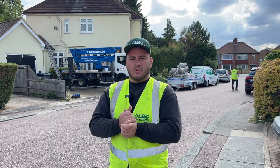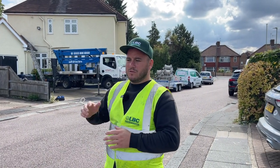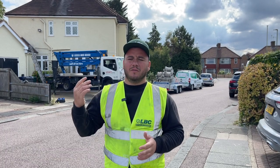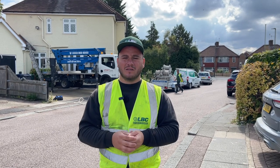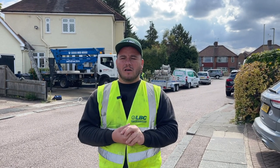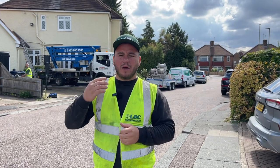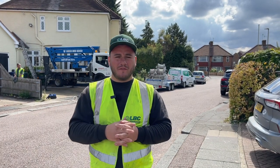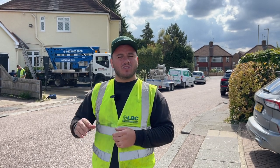So Doomy, you've just done the first application of soft wash. I've done the first coat of the bleach everywhere on the roof, and we leave it half an hour, 1 hour, depends how it's working. We'll see how it's going. And then my colleague Jim will come back to rinse off everything, try to clean off any small moss or something like that.